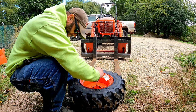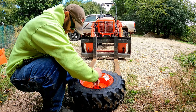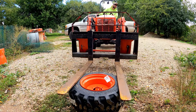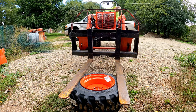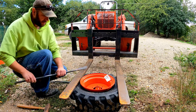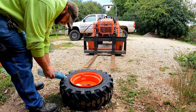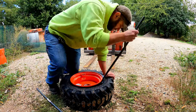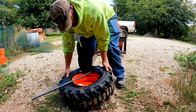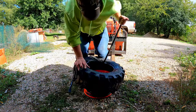Unlike the other two times I took the tire off a rim, this time I need to remove the valve stem core to let all the air out so I can pop the bead. The first time there was a big hole so air went out through the hole; the second time it was already popped off the bead. This is where I got smarter about popping the bead — using another tractor for help. It wasn't strong enough to pop it by itself, but with the combination of the forks and the tire spoon, the bead popped really easy and saved me so much time. Now that I've done this a few times I was able to dismount the tire, flip it, and remount it in about 20 minutes. Last time it took me over 40 minutes just to remove one side.